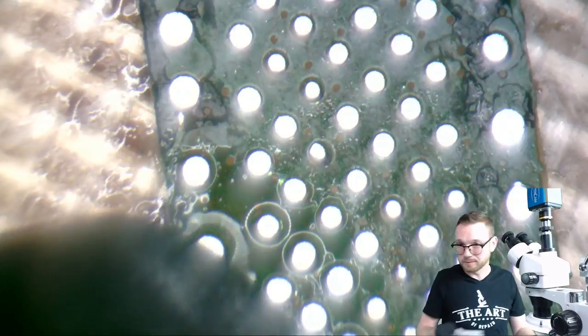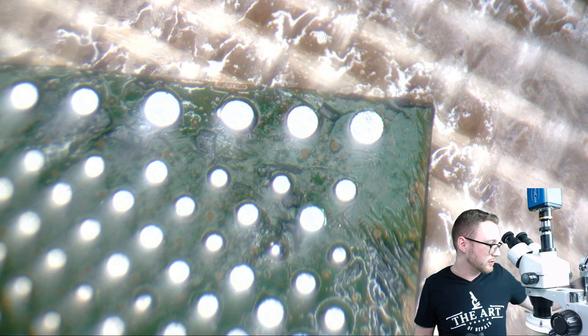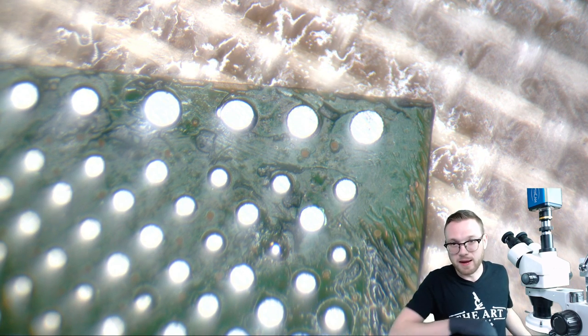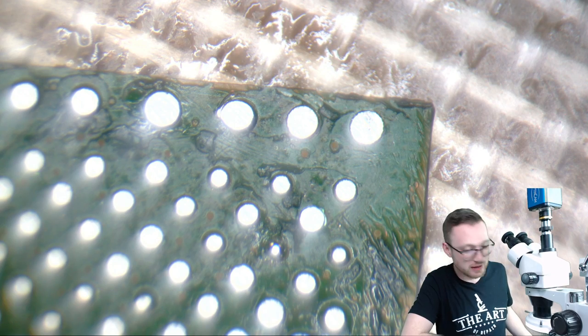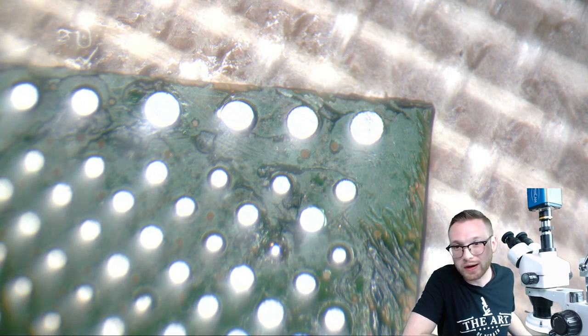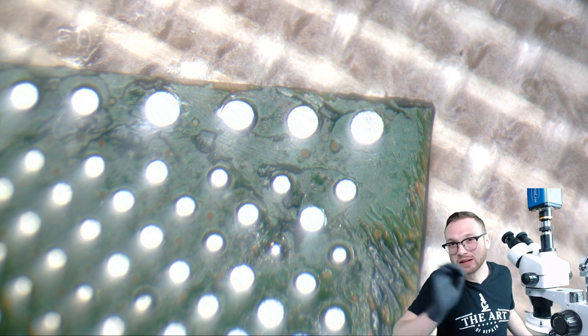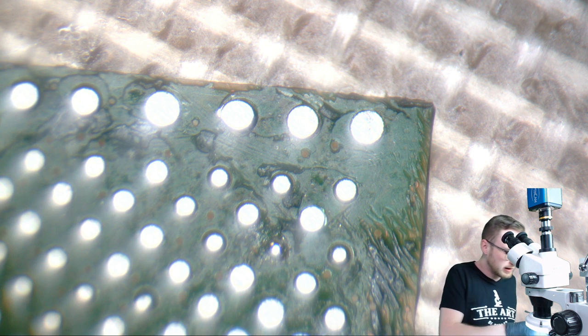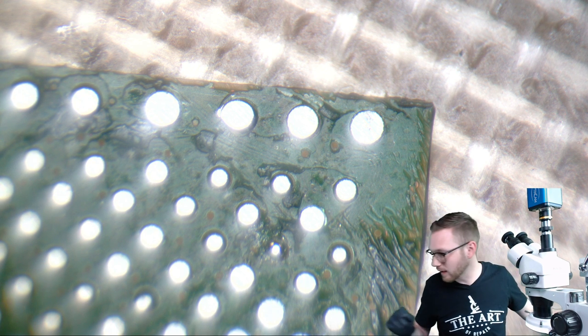All right. Now that we've done this, we're just going to go ahead and heat up the chip a little bit. Now, I'm not going to be baking this bad boy. I mean, we're literally just going to, probably like 220, something like that, just enough to get them to wet and kind of ball back up a little bit. So we're gonna add a little bit of flux to this bad boy.